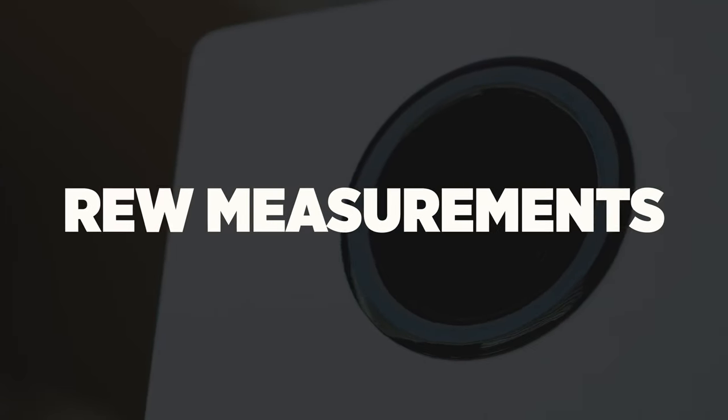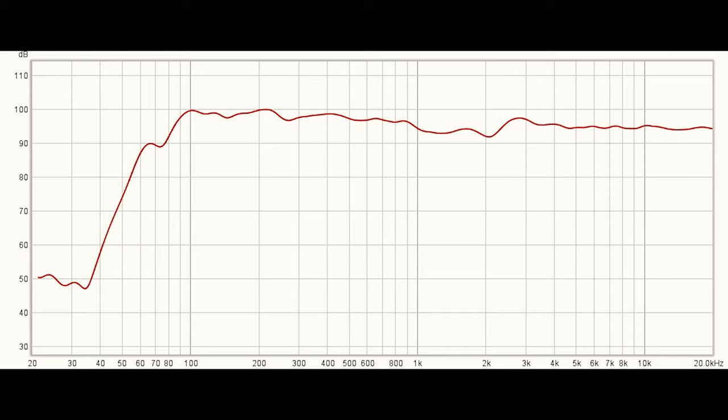Now it's time for the REW measurement. It is very, very linear, and the actual high end does not fall off — it goes well past 20 kilohertz. You could definitely assume that these are brighter speakers; however, they are not tinny or fatiguing. They were very, very nice on the top end, and they stay very, very nice and linear throughout the mids. They do drop off comfortably around 95 to 100 hertz. They dip a little bit, pop up around 60 hertz after about 10 decibels, and then kind of waterfall down. This was expected — they are a smaller speaker; however, they are very impressive with the mids and highs.